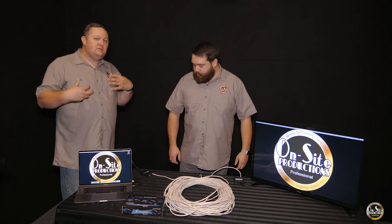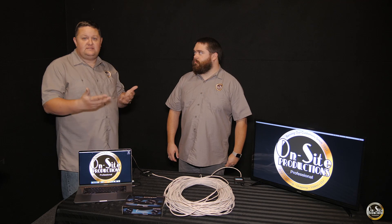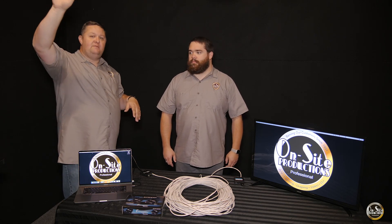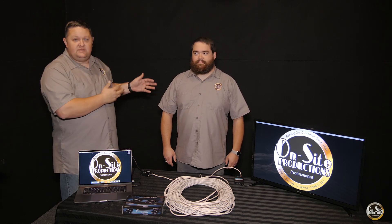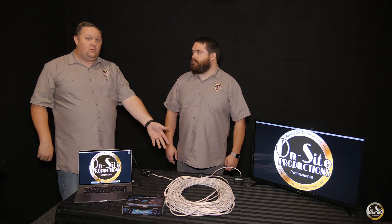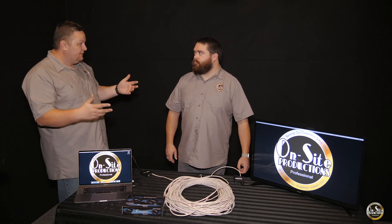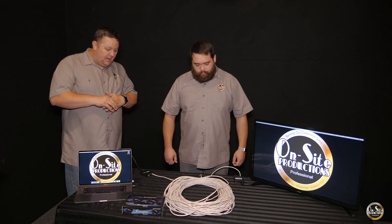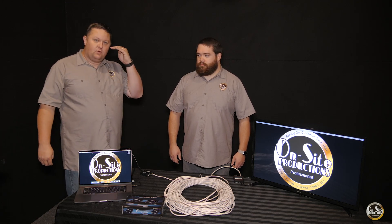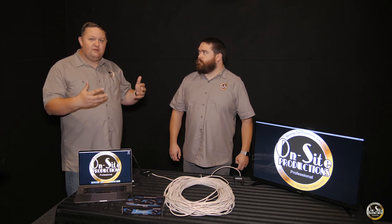This is a great product. We use them a lot in the installations that we do. For example, we just recently did a church where we had to send a signal all the way from the very back top of the balcony down to the stage and back up to the projector in the back of the room — and we did that with CAT6 cable. You can use CAT5, but CAT6 is becoming more popular. We always prefer to use shielded cable, which prevents unnecessary interference when running through conduit.